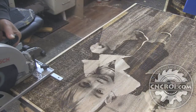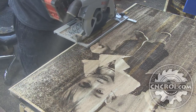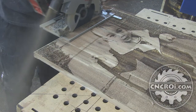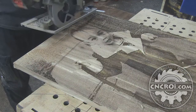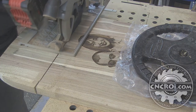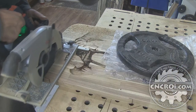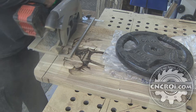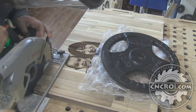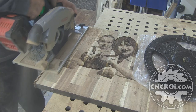Here I'm just using a skill saw — not an issue to cut this stuff. The material is roughly an inch thick, solid wood, and it's a laminate so there's some glues involved. I'm not too concerned about being totally straight, which is why I'm not using a track saw. Instead I'm just cutting it out and then I'll sand the edges flush as they should be. I did add a weight because I was pushing so much on the saw it was actually moving around the finished pyrography picture, so putting a weight on it solves that problem and I get a nice clean cut.